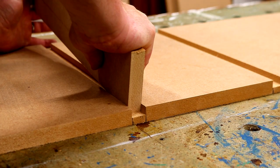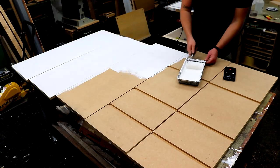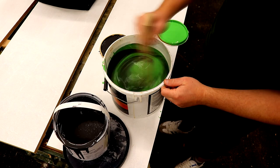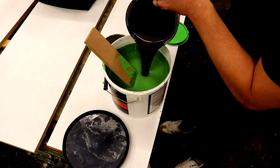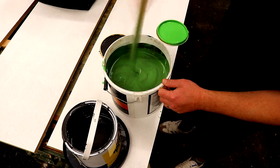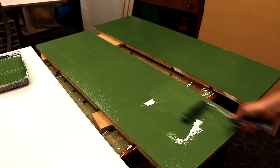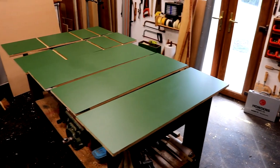I test the fit and it looks good. I can then sand away all the dirty footprints using 120 grit and I applied some acrylic primer before painting. I have some hideous green paint which is way too vibrant for my liking so I mixed in some dark grey to tone it down — I'm aiming to get a nice deep green colour which regular viewers will know is my favourite. Here's a before and after and I'm really pleased with this colour. I'm using a roller to apply it as it's quick, easy and it leaves a great finish. It gets two coats in total and it came out lovely and smooth.